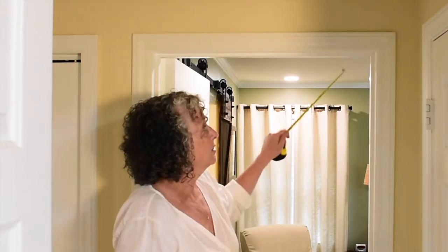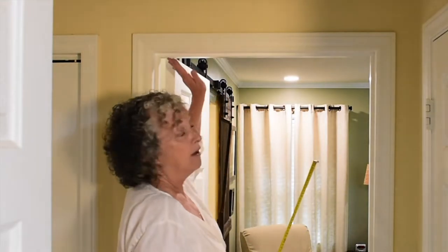Let's start with how to measure for an inside mount. There's no perfectly straight, perfectly square window out there, so you're going to want to take measurements in two or three spots. I usually take them in three spots horizontally across the window and two spots vertically. I'll measure near the top, near the middle, and then at the bottom near the window sill. For my vertical measurements, I'll take a measurement on the left and on the right side of the window.